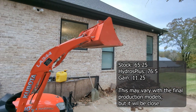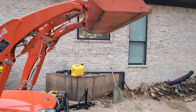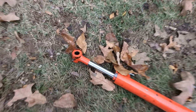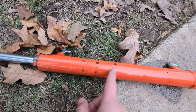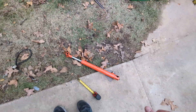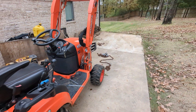I'm reaching up here — quite a bit higher. And because of the way Kubota does their loaders with more reach, you still have plenty of room. Probably as much if not more room than you have with a John Deere, just based on the loader geometry. See this extra stick-out? We can take advantage of that by making the cylinder longer essentially, and by taking that in you can end up with the same retracted length but more extension length. That's where we get — what is that — 11 inches. That's quite a bit.